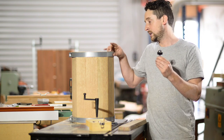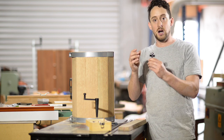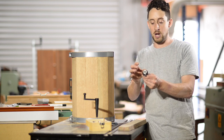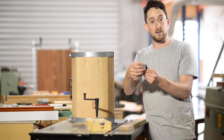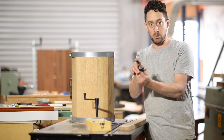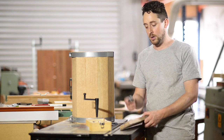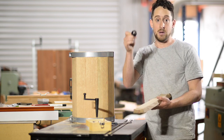My timber is about 23mm thick. I've decided to use a 6.5mm rebate, which basically coincides with using a 25mm bearing on this 38mm bit — that adds up to about that 6.5mm depth. That 6.5mm was just chosen because of that bearing.